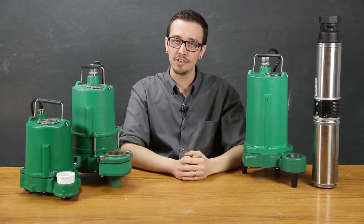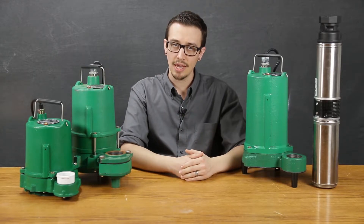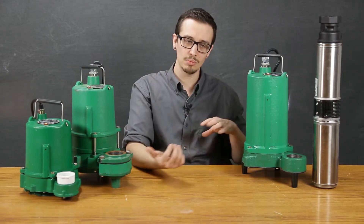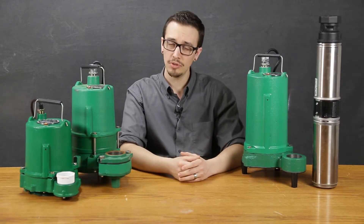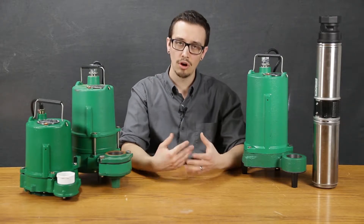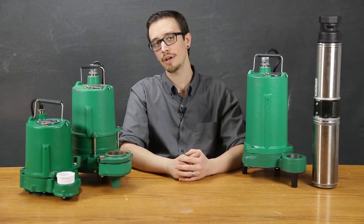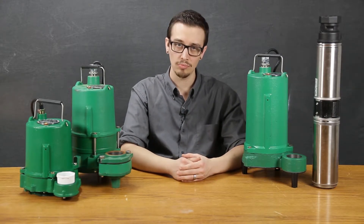The maximum head of the MES series is upwards of approximately 90 feet and the maximum capacity is about 88 gallons per minute. The preferred operating range of the MES 50 half horsepower is somewhere between 32 and 50 feet of head. The discharge size on this pump is 2-inch NPT and it has a maximum solids handling capability of three-quarter inch. The motor speed is 3450 RPM, which features upper and lower ball bearings for maximum life. This particular pump features a carbon ceramic seal — a type 21 mechanical seal — so it is recommended specifically for effluent applications and not utility dewatering applications, where you would want a harder seal due to the possibility of abrasives and sediment.